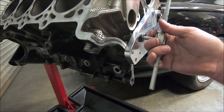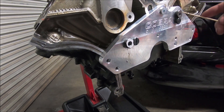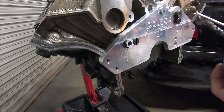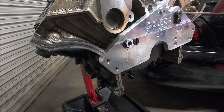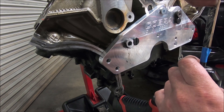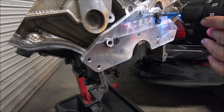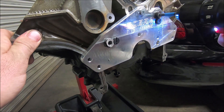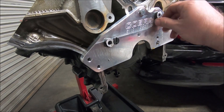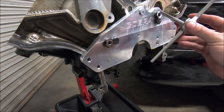Now we can take it out. Now we've got the smaller fitting over on this side. Check the depth on this one, transfer that to the drill, and double check it. Spray PB Blaster in there, drill it out, and clean it out again. Now swap to the bigger guide so we can tap it, and work the tap in there.